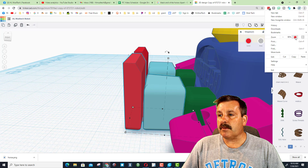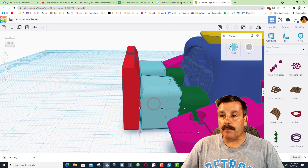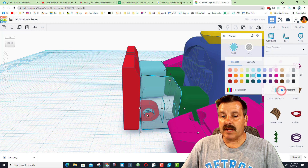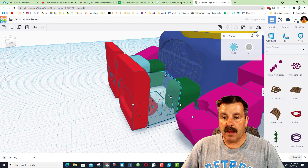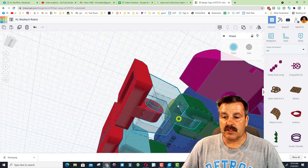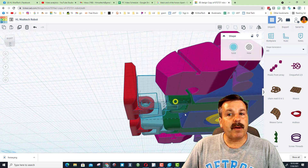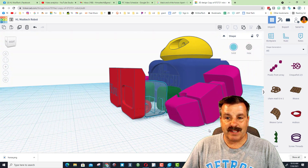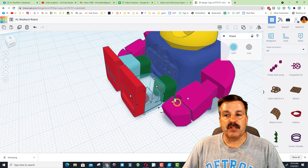I'm going to switch my zoom back to 100% and show you around my design. Right here, if we click transparent, you can see that this fits inside here, and this has that same tongue so that it comes back. In theory all of these legs will move. It depends on how well your printer prints — if it prints a little wider than it's supposed to, they'll be super snug.